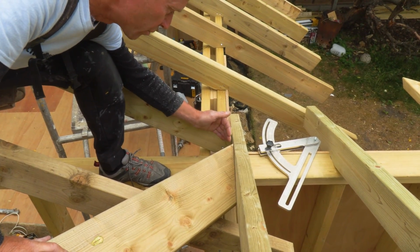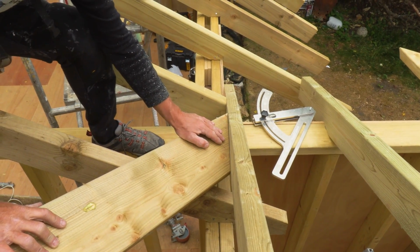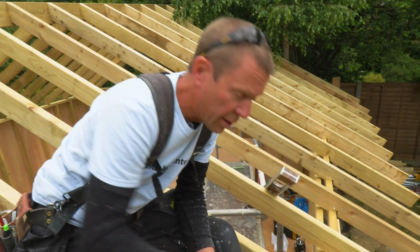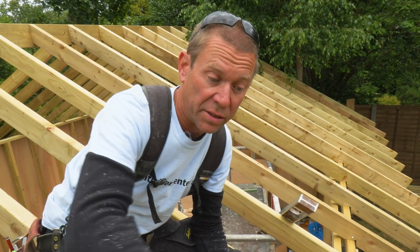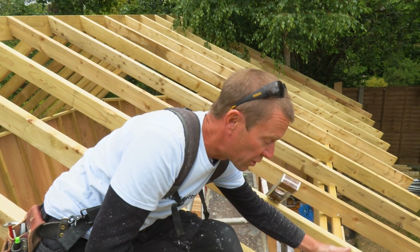You can do that on the skill saw. That's the same as this roof. And then this one is 47 degrees. It was off of the top one was 43, that's 47. Why's that? Because it all adds up to 90. So as long as it all adds up to the magic 90 for the square, because this is a square. So 43 top, 47 at the bottom, 30 on display.